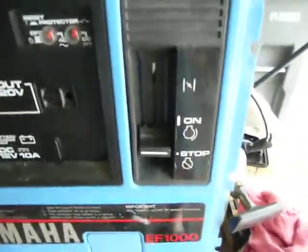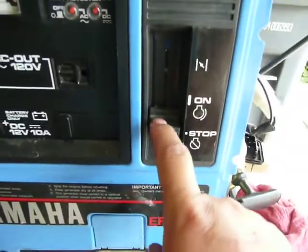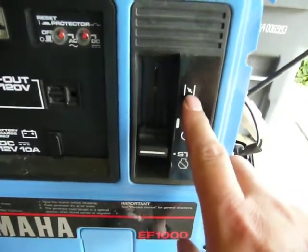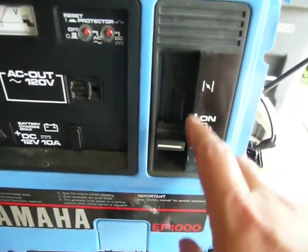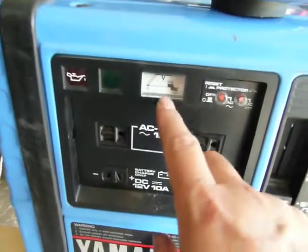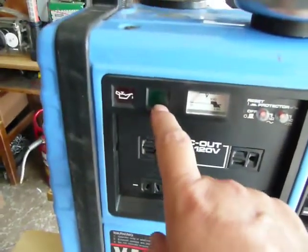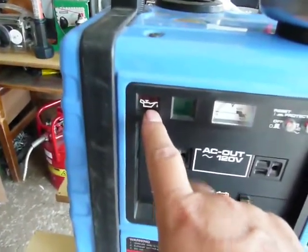In the front, there's basically a control panel. There's a stop switch, which also shuts off the fuel. There's the arm and the choke for when you start the engine. You start it, let it warm up a little bit, then move to the run position. You have two outlets and a meter. There's a running indicator — when it's green, it's good — and warning lights. When you're over your load limit, it goes red.